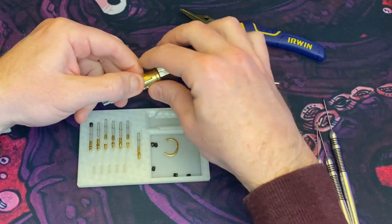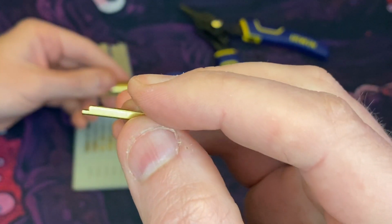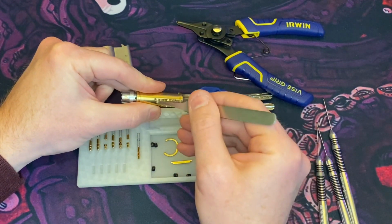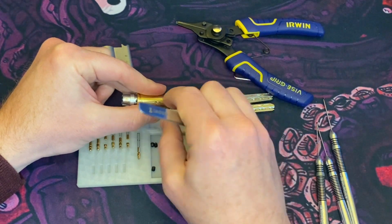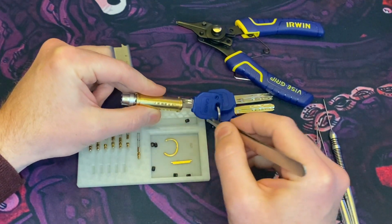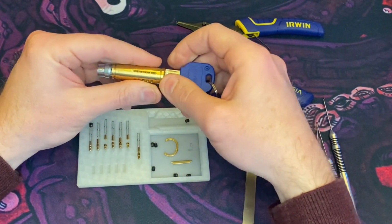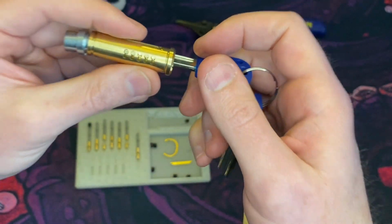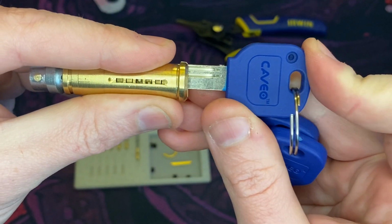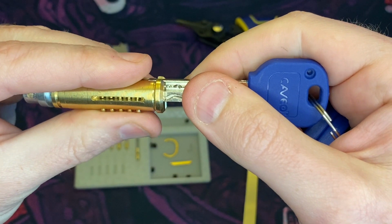All right, so grab the sidebar. That looks solid. Okay. Let's get these springs before I lose them. Okay, there's your sidebar springs. And you can see the sliders are intact there. I'll pull the key. So it looks like maybe just a true gate on each one. Yeah, I don't see a false gate.